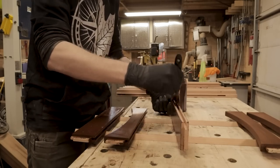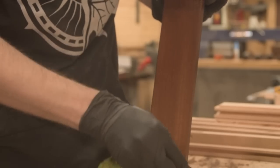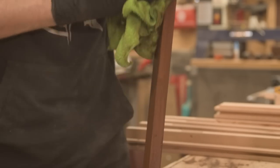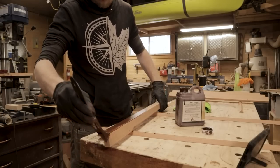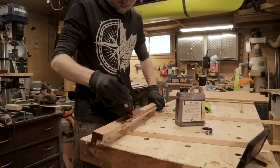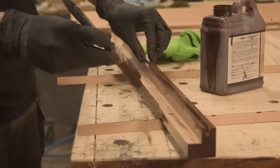The stain I'm using here is a water-based pigment stain. It's very important to mention it's a pigment stain, because what that means is the stain is sitting very much on the surface of the wood and can give you paint-like accuracy in colors. At this point I was actually pretty happy with the color because it gave me this nice rich dark brown color that I really want. I know this is very close to what cherry ages to, but that's kind of what I want to see as I get to use this thing myself.